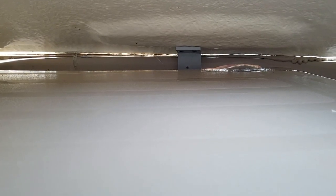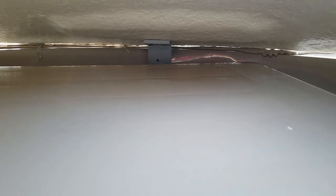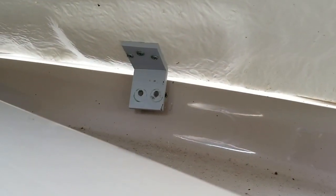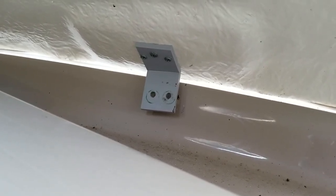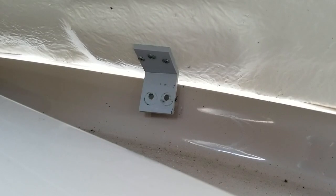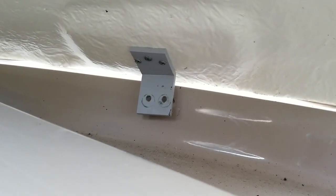Looking toward the back you'll see the top of that gray bracket — that gray bracket has two screws holding it in. Just reach in there with a Phillips screwdriver; the longer the screwdriver the easier it'll be. On this side you have a similar setup with the bracket. You've got three screws that are vertical and two that are horizontal. I took the two horizontal screws out with a Phillips screwdriver — they came out pretty easily. Up here, that's all you really have holding the helm: those four stainless steel screws.